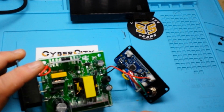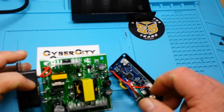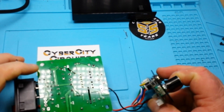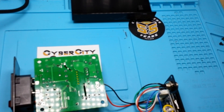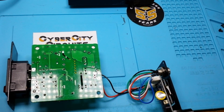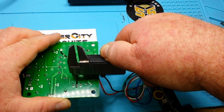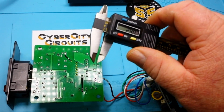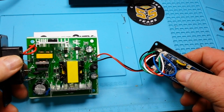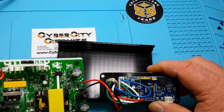There you can see our MOSFET driver, transformer, really simple circuitry, diode bridge. It's well built — you can see they've got nice separation, nice tracks. We can actually measure the distance in those tracks with the digital calipers — you're looking at 2.3 millimeters separation there. Really nice. Again, it's just well done. You can see an opto-isolator there — that's the only thing bridging the gap between the high and low sides.